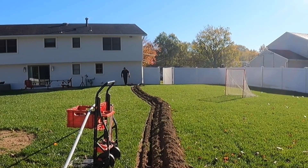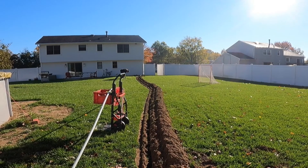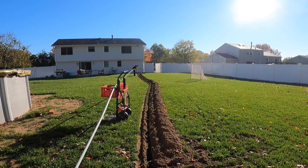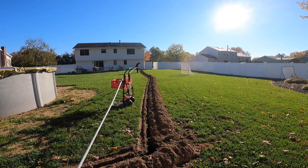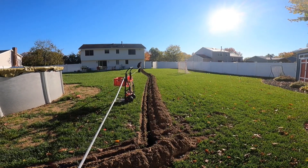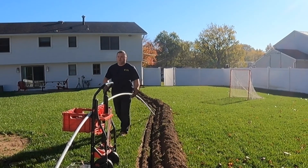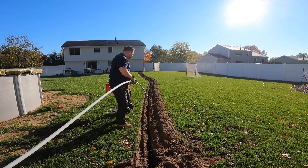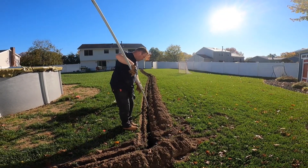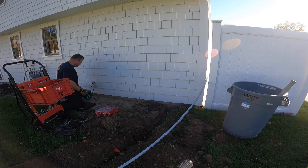The simplest way to put this conduit in without getting dirt inside is to put the conduit together first and then lay it in the trench. Sometimes this is easier than it looks, but it does turn out to be a better job and takes less time. I always like to run my conduit runs a little bit longer and then trim them back to size so I can stub up on either end at the house and at the swimming pool equipment. Here the conduit goes around 45-degree turns without having to heat up the conduit to make a bend or use any prefab connections.